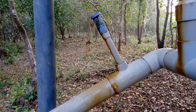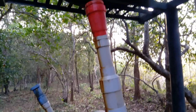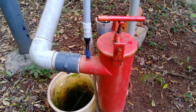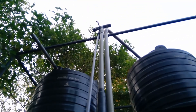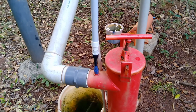Initially I put in the air pressure release valves but was still not getting enough pressure because air was getting stuck in the pipe. I applied one more air filter but still wasn't getting enough pressure. Then I realized the air was getting trapped somewhere in this section. Finally, I put in a pipe that goes straight up above the height of the water tank — not exactly an air release valve, but it worked. After putting in this air release system, I was getting enough pressure.